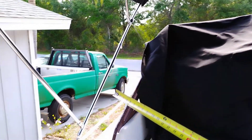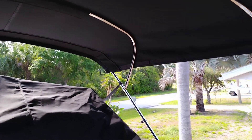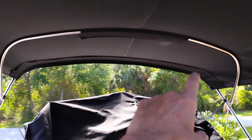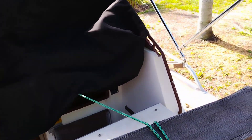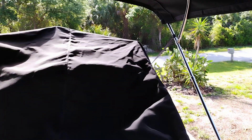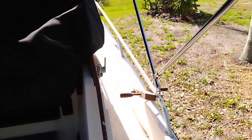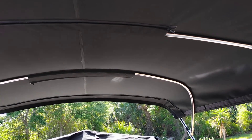You need hinge to peak front, hinge to peak back — all four should be the same number: 85 inches here, 85 there, 85 up here, and 85 back there, or 84, whatever it works out to. Usually the width is a little bit narrower than your rail width — it toes it in slightly. If you make it too big and square it wiggles more; a little toe-in is better, but still as wide as you can get it.